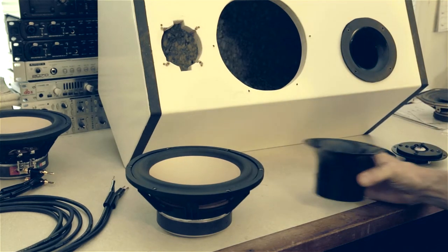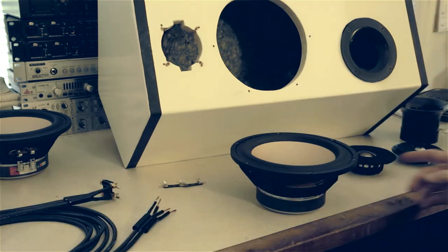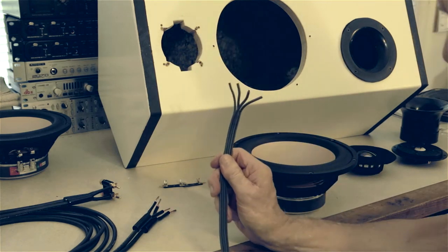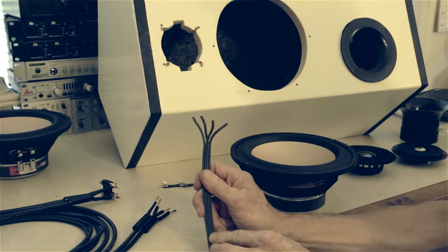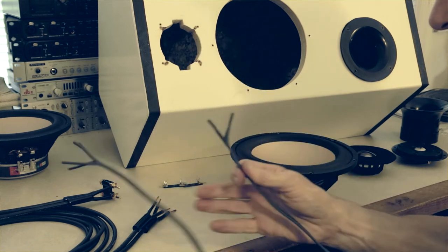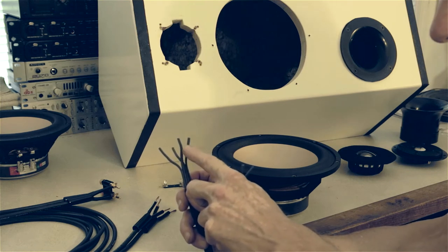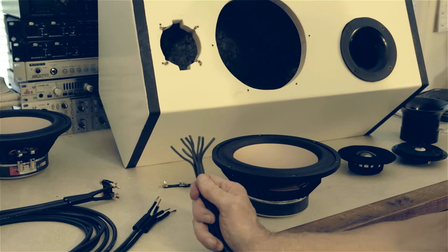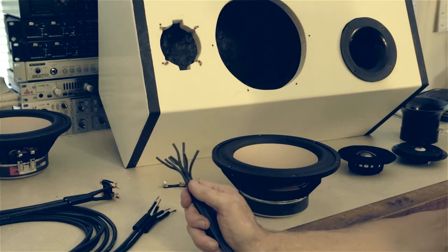The second change had to do with the speaker wire. I did a video on speaker wire recently, and one of the things I discovered — let me grab that speaker cable — this is the FT4 wire that I used for this project. I had one run of this for the tweeter and then doubled up the run for the bass mid driver, because my thinking was there probably wasn't very much copper here for the bass. My experience has been that running heavier speaker cable for bass improves the bass response.